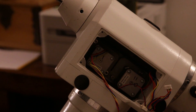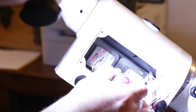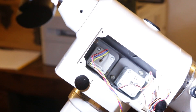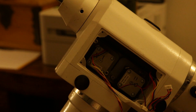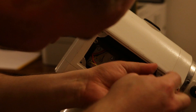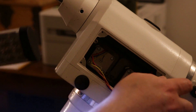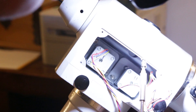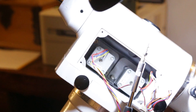The next step is to remove the mulchers themselves. They are held in place with socket cap screws - there are two for each of the mulchers. I'm going to use a screwdriver with a bit and take them off. Should be fairly straightforward. Give me a little more light - it seems there are a couple of washers on the screws, so be careful not to drop them into the mount. There's a locking washer and a washer on each of the screws.